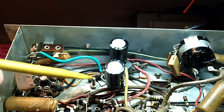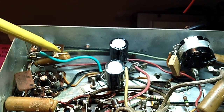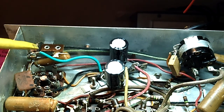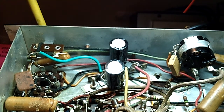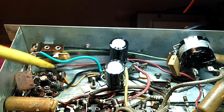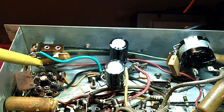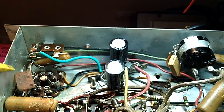After that's done, I've got to get underneath this one up here in the corner to get that cap out of there. The problem is this terminal strip is riveted to the side, so I'm going to have to either try to unsolder it or figure some other way to get it out - I can't clip it because I can't see the other side.